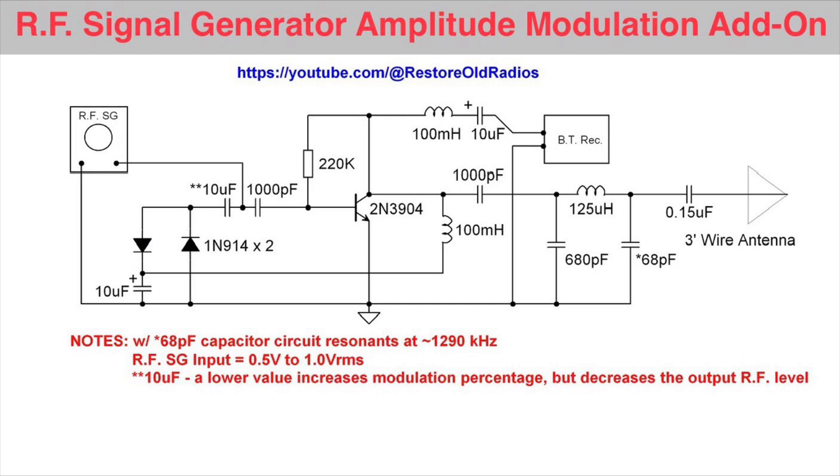It can be modified just by changing some of the components in the tank circuit. There's no DC voltage required — I'm actually using a couple of diodes to power the 2N3904 transistor off of the CW carrier. It creates a nice, short, close proximity transmitter for those that have a need to do so.